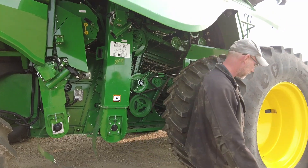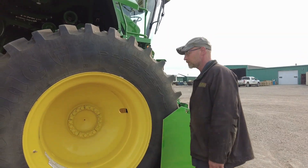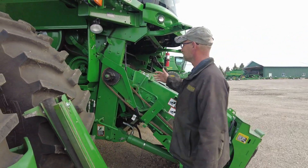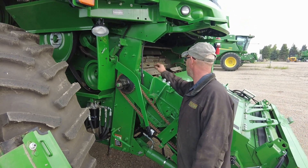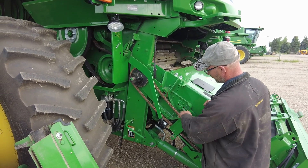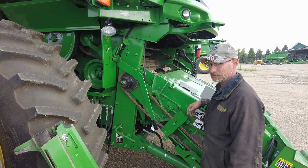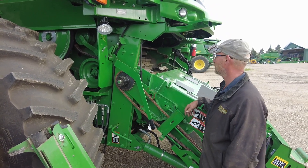As we come back around the front side, take a good look at your rims and your wheel bolts — look for any kind of stress cracks. Then back around the front side, take a good look at the condition of our feeder chain and our top sprockets. Look at your feeder chain here — it may seem like it's tight, but make sure you take a good look at where the slot is. If it's all the way forward on the slot it's not going to self-adjust itself, so we're going to make sure we're taking half links out as needed.